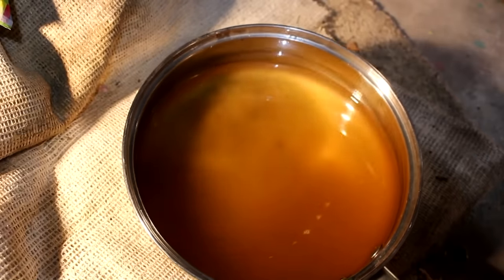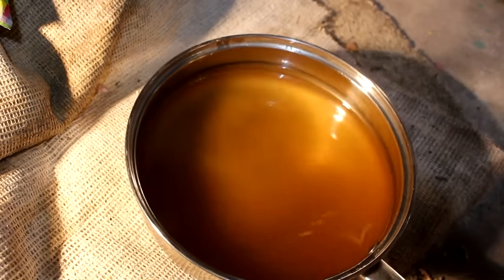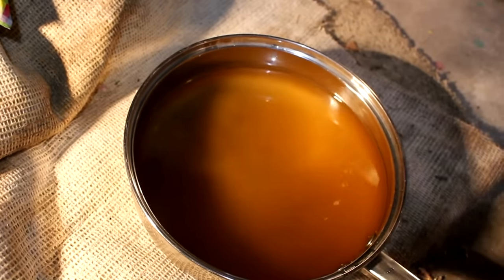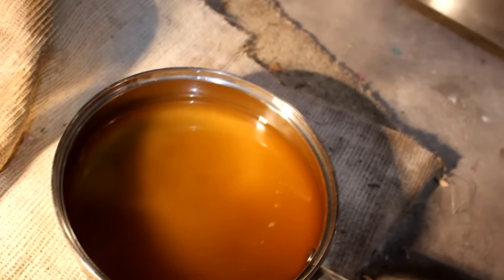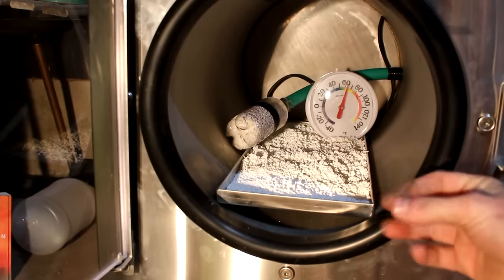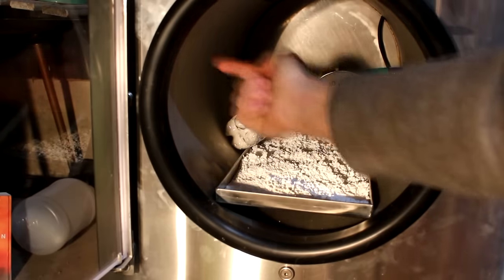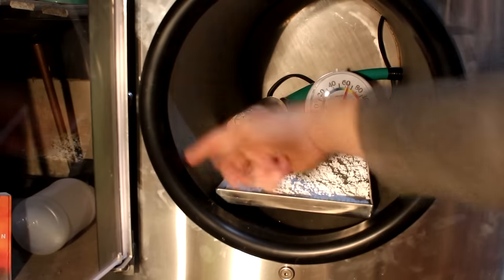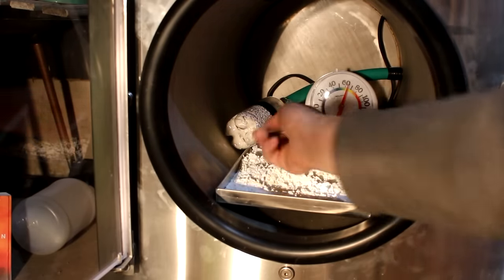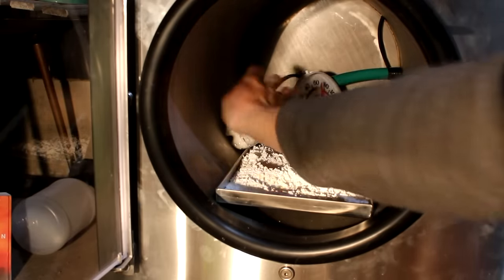So here's the water out of the pump. As you can see, there's some droplets in the bottom and it's very cloudy due to suspended water. So that's not very good for it. So I've done a few things differently for this next run. Having liquid water in there made far too much water vapor come up. And since I'm doing this run with the chamber warm, I'm not even going to have it attracting to the sides of the container. So to help mitigate that, I've added in some desiccant here in this tray and also inside of a little scrubber on the end of that hose.